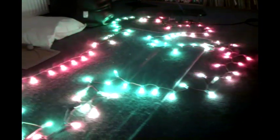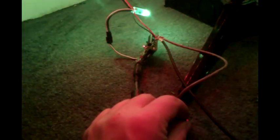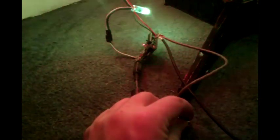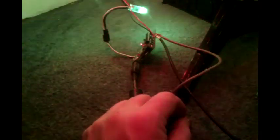I get them wrapped around the tree now. The Arduino board there actually controls the LED sequences and I've got a pot on it. I can turn the pot up and down to change the flash rate. What it's doing is it's generating a sine table — it's fading between red and green.